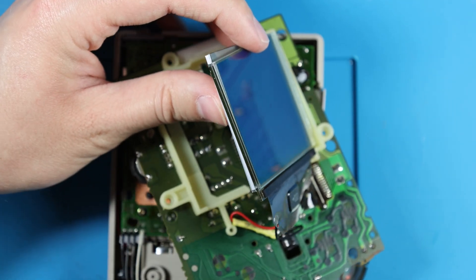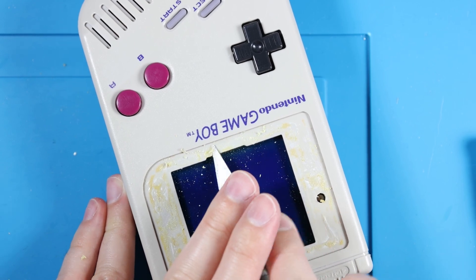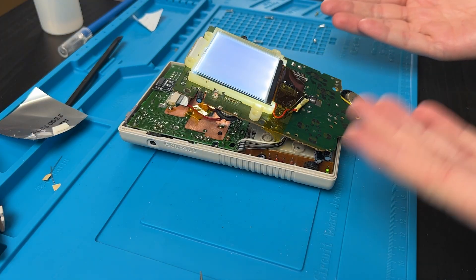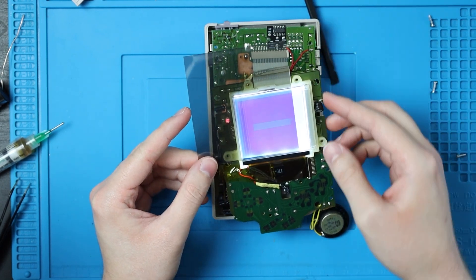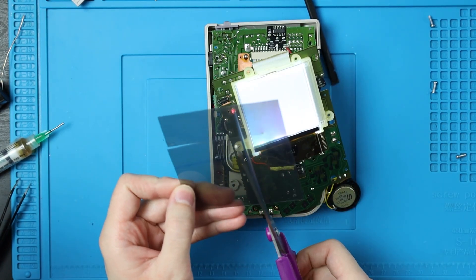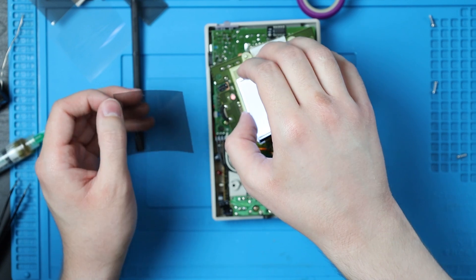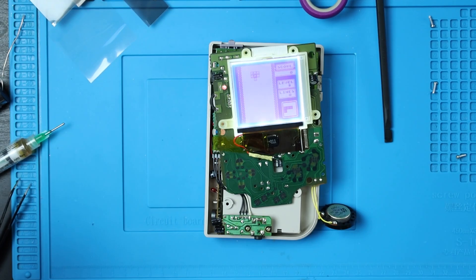Before you go any further, I highly recommend trimming the plastic here to guide the wires out, unless you're okay with the screen lens not sticking down right because the shell is bowing. You're also probably going to want to scrape up all that old glue to get your screen lens to actually stick down properly. Now you're going to want to power the back half of your Game Boy. Before we turn it on, we're going to plug in the ribbon cable. Now we can turn it on — our backlight will be on, but we can't see anything. That is where the polarizer comes into play. We can lift this up once again and slide it through there. And now we can see the screen — and that I have lines on the screen that I need to fix. Assuming you're using the bivert chip, if it looks like this, rotate it 90 degrees. Then you're going to want to cut it to fit between the backlight and the screen. We can peel off both sides — try not to touch anything but the sides and don't lose the orientation. Slide our backlight in there. Very nice — that is what it should look like.